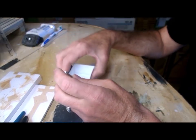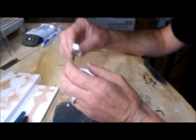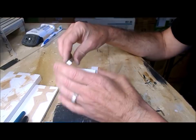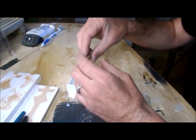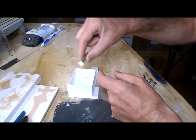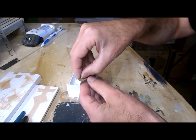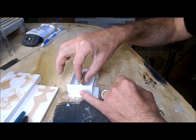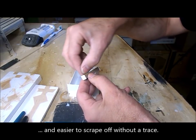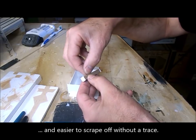Now when designing the box we have to remember to leave plenty of space around it because there are going to be other things cut into the mold. And to avoid getting parting lines down the brick surfaces, I'm going to mount it diagonally like that, so that any parting lines are on the corners where they're going to be less visible.